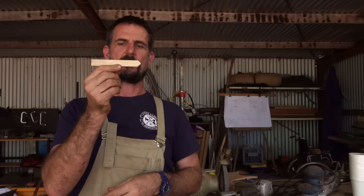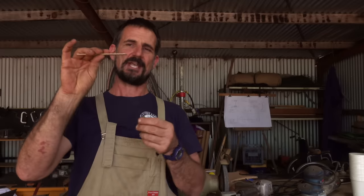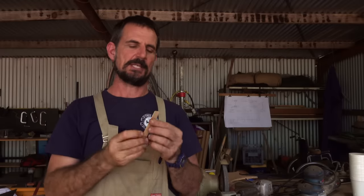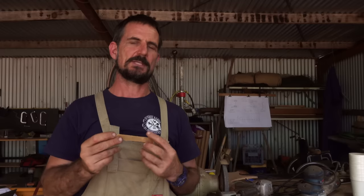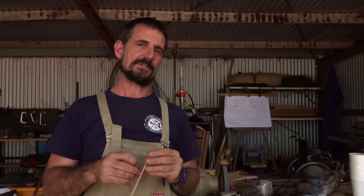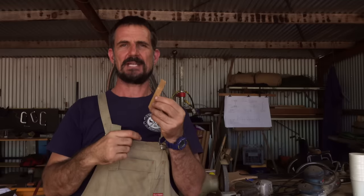That's a really handy tool — very quick to make. Whenever I'm doing any epoxy work I like to have these. That chisel edge is really nice to use — just scrape up any epoxy. The name of the game when working with this, particularly with glue powder in it, is to avoid any mess you'll have to sand off later, because it's really hard to sand off. There are additives that make epoxy easier to sand, and glue powder is not one of them. A sharp bit gets into corners and a chisel scoops stuff up — but don't make it too fine because as the epoxy starts to go off it gets a little rubbery.